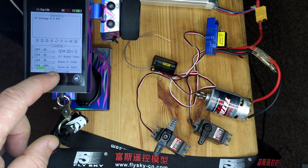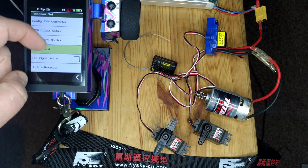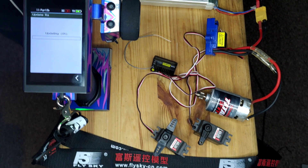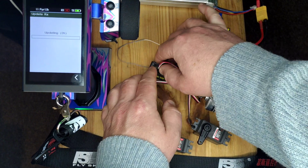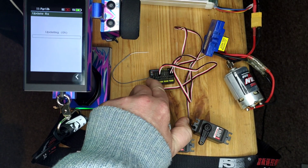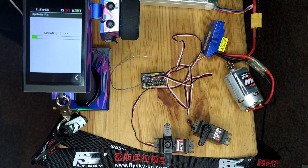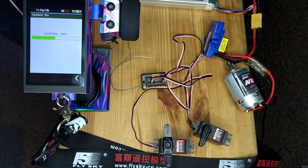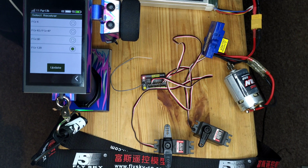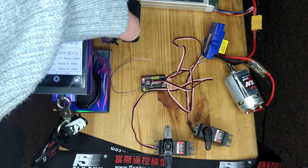When the new firmware update comes out, you update the FGR-12B the same as the FGR-8B. Basically, go down to update receiver, set it to FGR-12B, and click update. Then press and hold the bind button and power on your receiver. Keep it held down until it starts flashing slowly, then it'll go through the update process. If it's writing new firmware you should have to re-bind, but if you're just writing the same firmware it'll stay bound — and yeah, it connected straight back up. That's the firmware update process for the FGR-12B.